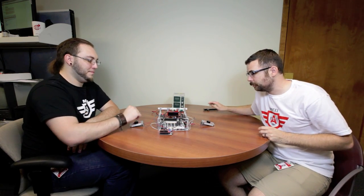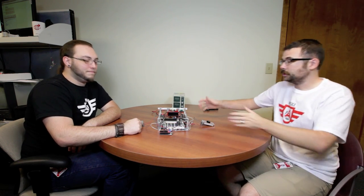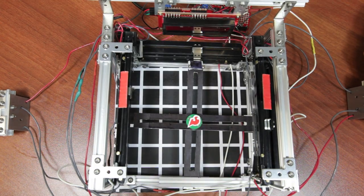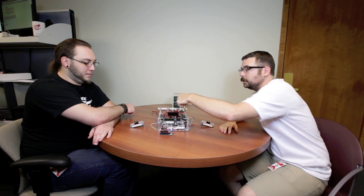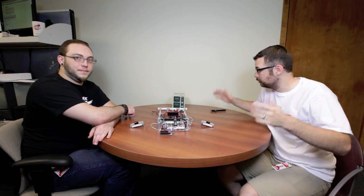We took these and put them together into an interesting little project — here is what we built. This is a brainchild of mine, but Nick ultimately created it. This is Mechanical Pong. What we've done is taken four of these linear potentiometers, a little bit of Maker Beam, a couple of Arduinos with the Ardumoto shields, and a couple of paddles which just use a potentiometer. The ball, simulated here by a little SparkFun flame, will move around driven by two potentiometers, and then we can move the paddles individually and play Mechanical Pong. There's even a little readout that tells us the score.